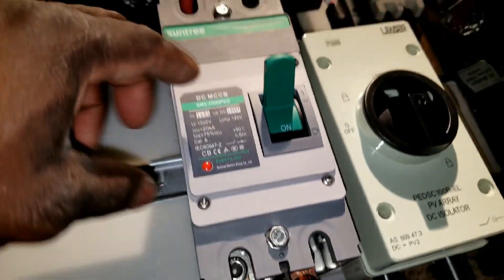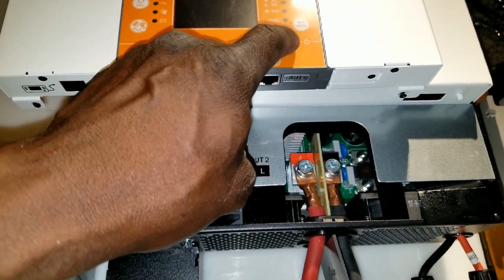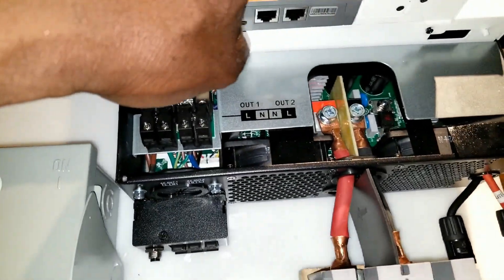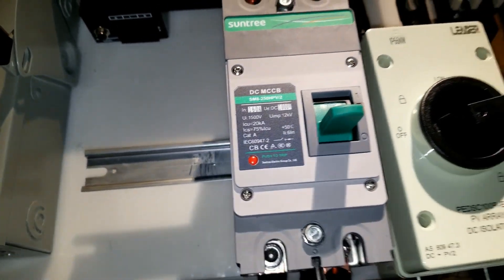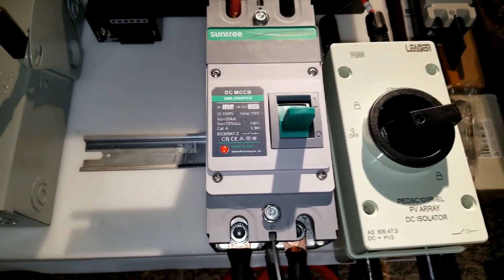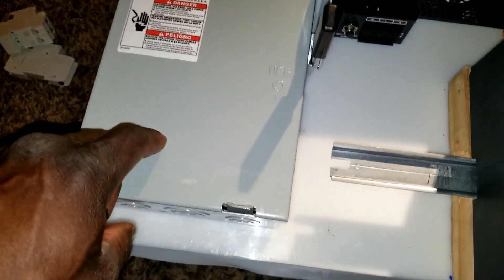The system is now running. If you want to shut down the system, make sure you go in reverse: turn the panels off first, then turn the power here on the inverter, then disconnect the batteries — that's the sequence. Like and subscribe, JW Solar USA, thanks for watching, love you guys. We're gonna be installing this box right now.